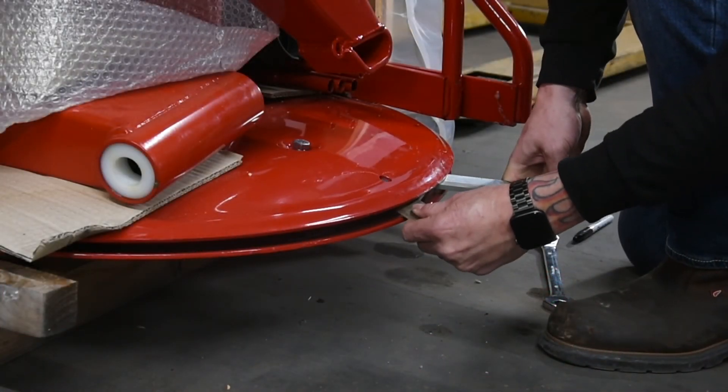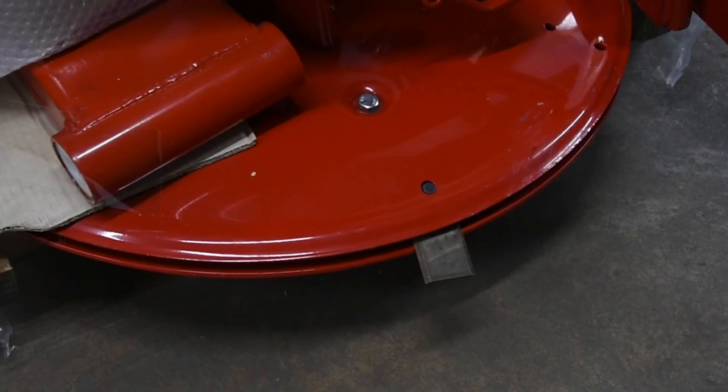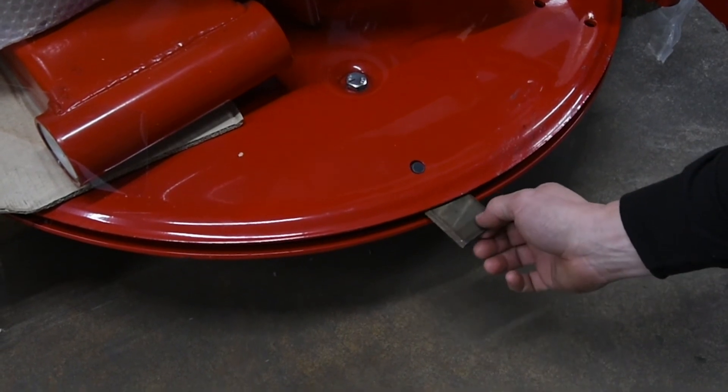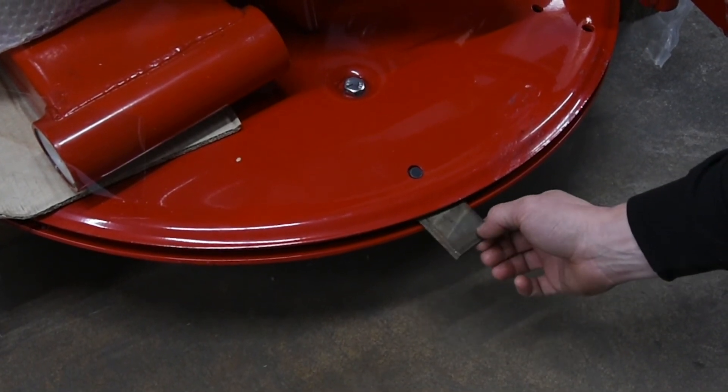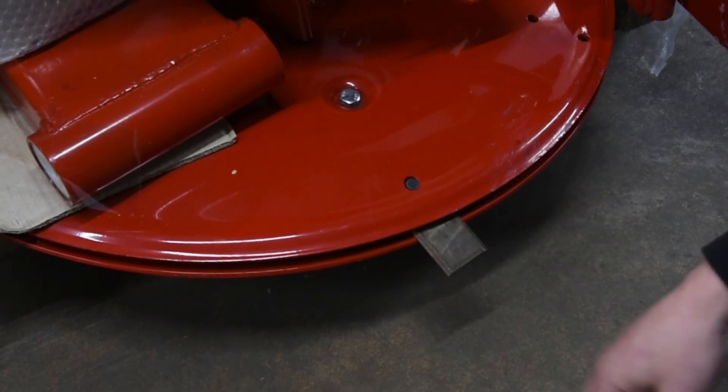Ease the pressure slowly on the blade changing tool and then tighten the safety bolt back down snugly. The new blade should be secure yet also be able to swing freely around the pin. If it is stuck and hard to move, it is likely not on the pin, caught or pinched, and will need to be reseated properly for safe operation.